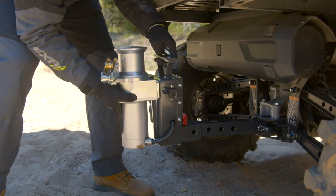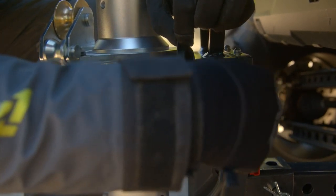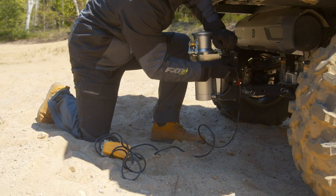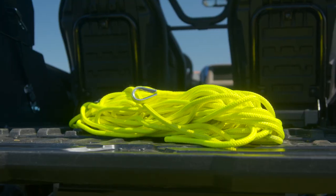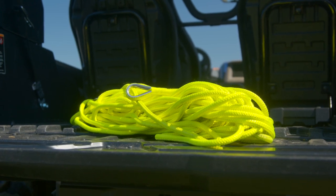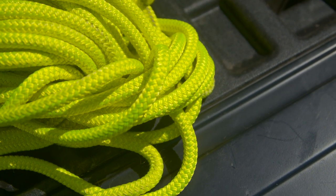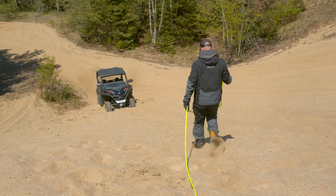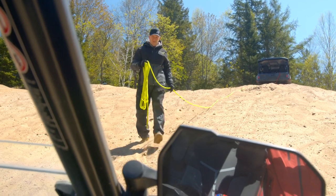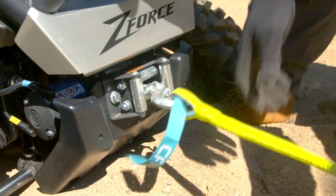But what do you do when 50 feet isn't long enough? Adding a capstan winch to your toolbox opens up a whole new realm of possibilities. This capstan will pull a constant 2200 pounds no matter the length of line, because it does not bail the line onto a traditional drum. You can use any length of rope you wish. Today I'm using a half-inch by 75-foot double-braided low-stretch rope from Princess Auto — already longer than most traditional drum winches.